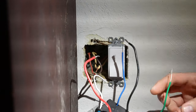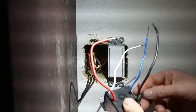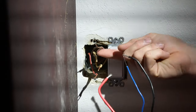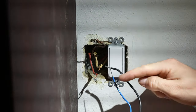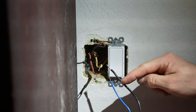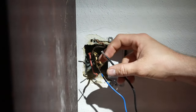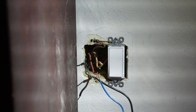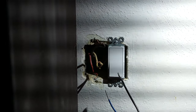So we're going to have several wires here. The ground is going to get grounded. The white wire here is for our neutral — that's not going to connect to either of the traveler wires; it's going to connect to the neutral in the back of the box. Then we have three wires that connect to the switch wires. My flagged black wire is actually going to connect to my red wire. The other two we'll notate: white to blue and red to black.